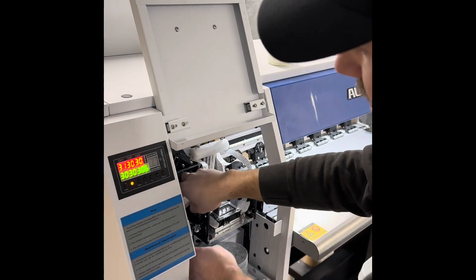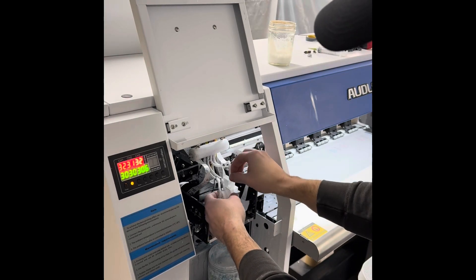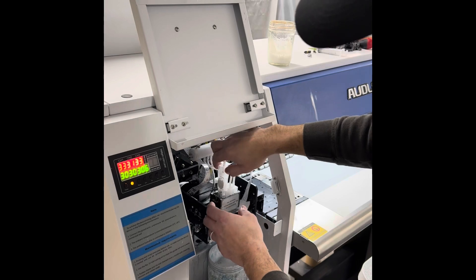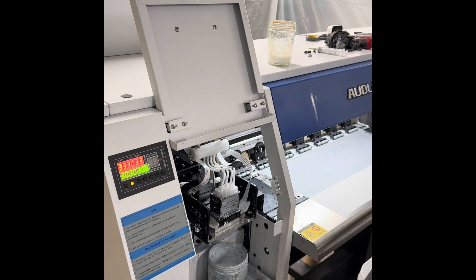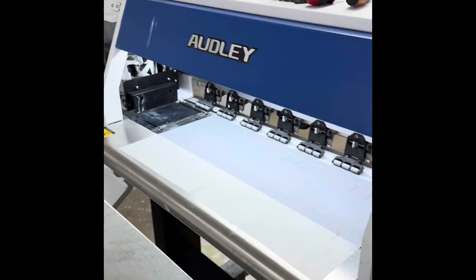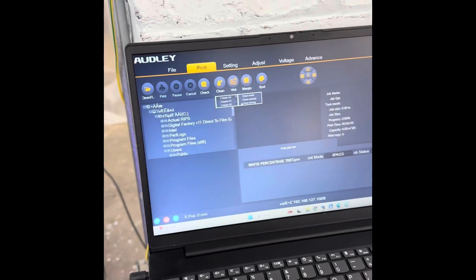Now I'm going to reassemble — got to do the heater first. Then the damper. It's really drippy right now because it's a little looser since I just primed it, so watch where it's dripping and don't drip it on your ribbon cables. I'm going to run one cleaning cycle and wipe the bottom of the print head because it's covered in a ton of crap. Just press enter to bring it back, make sure everything's clear — Clean Head Strong.